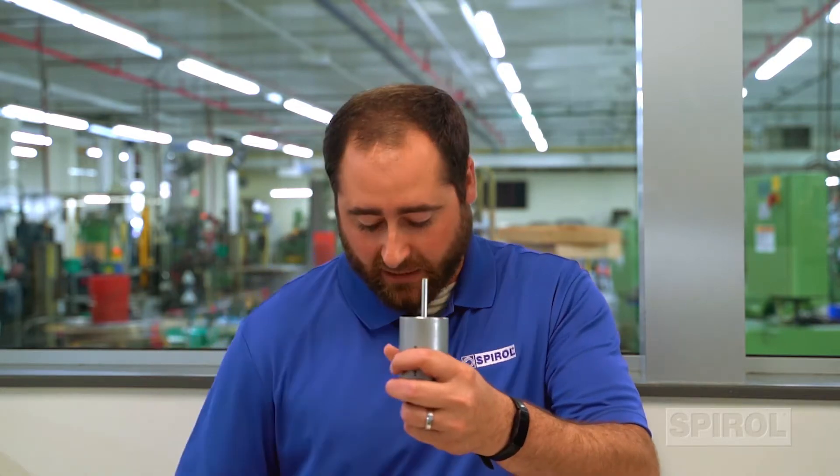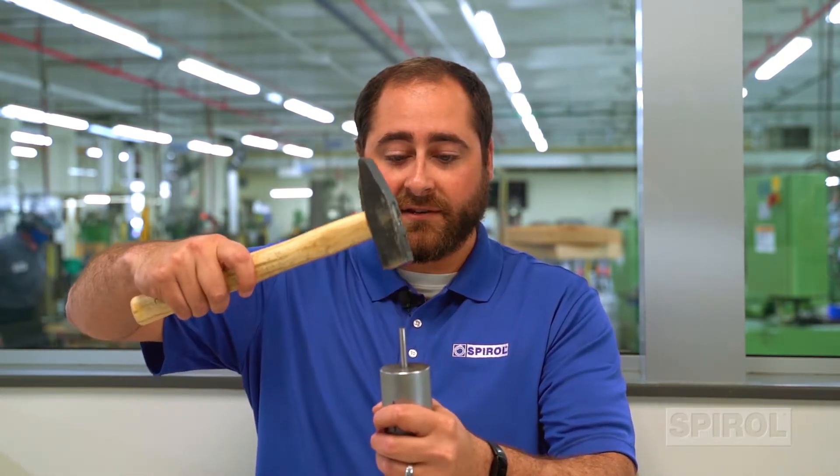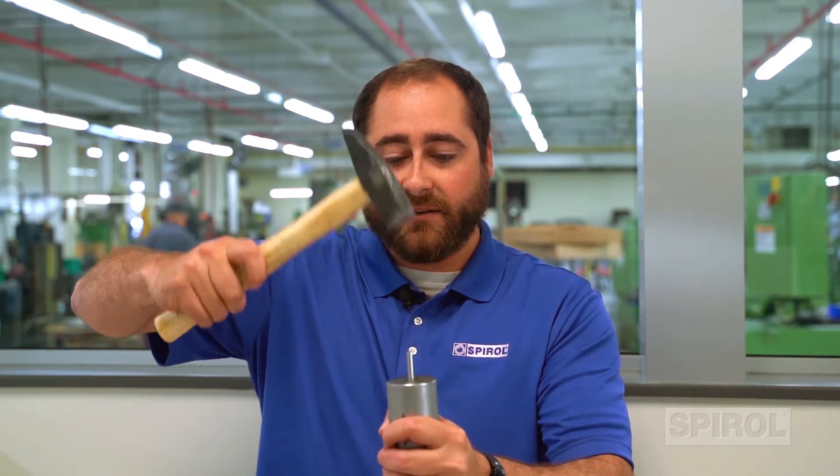It's important that the punch is just slightly smaller than the diameter and captures all the outer coils of the coil pin, because if the punch is too small, it telescopes the coil pin. If the punch is too large, it plows through material in the assembly. So grab your punch, align it in the assembly, and grab a hammer or a press and advance the pin until it gets removed from the assembly.